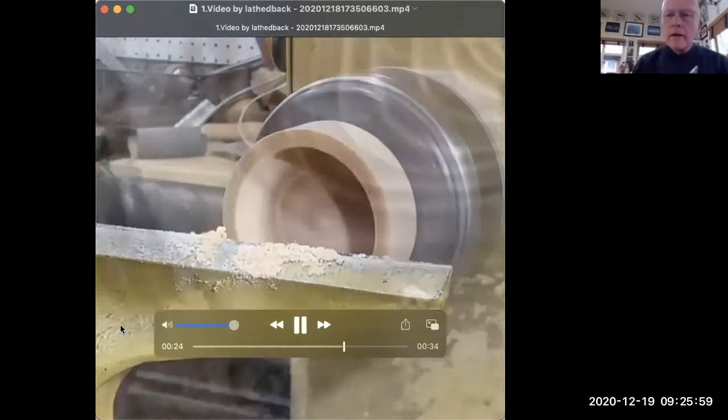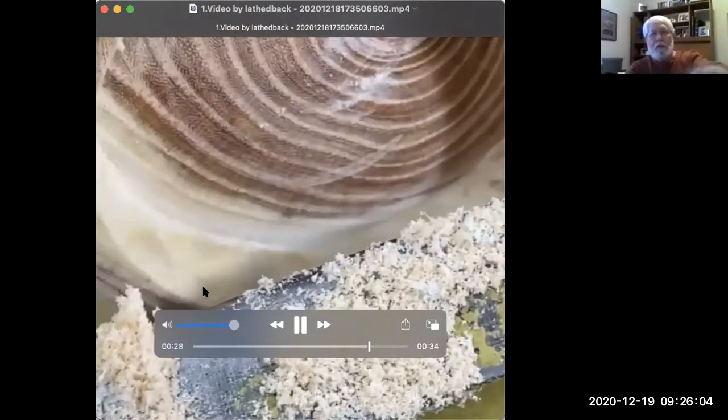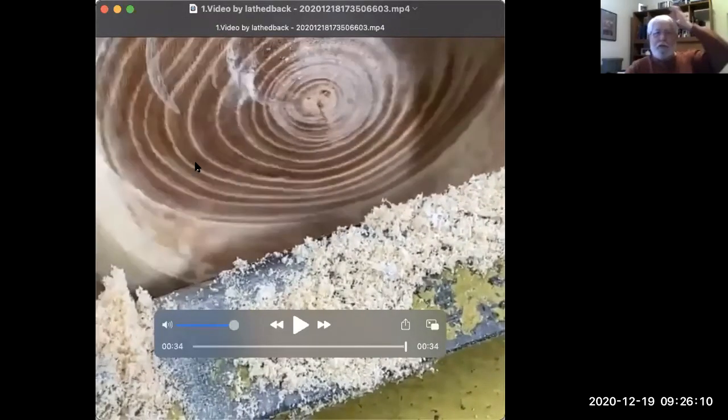The fact that there's a flute in there gives it stability from rolling sideways. Yeah. So it eliminates or controls the torque in a rotational sense along the axis of the tool. I just take bar stock and grind it flat on the top and on the bottom.